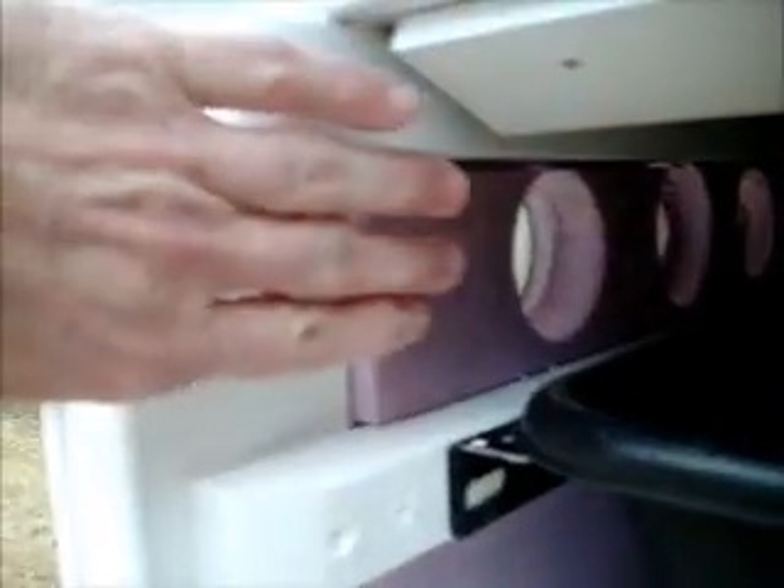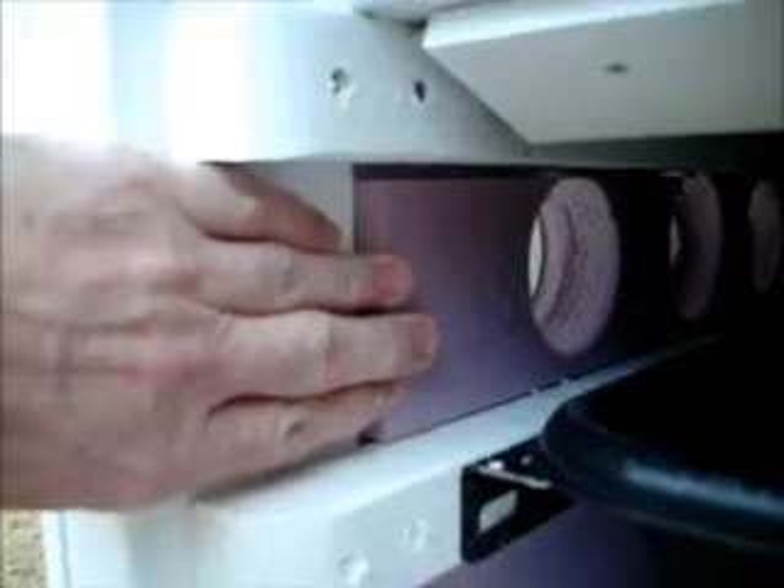You can see the three holes on each side for ventilation. To keep the door down and closed, I have magnetic catches on both sides. For extra insulation at the bottom, I have R10 two-inch insulation on the left and right, and all the way in the back you see a little pink — that's R4 as well. So R4 in front and back, and R10 on the sides.